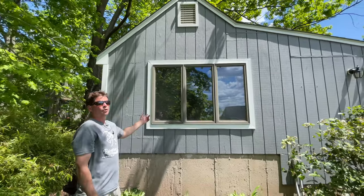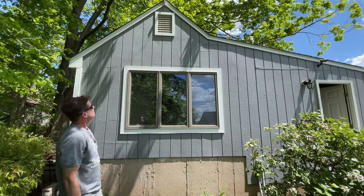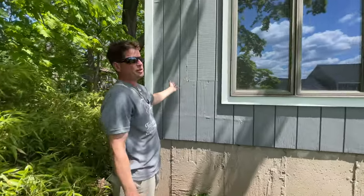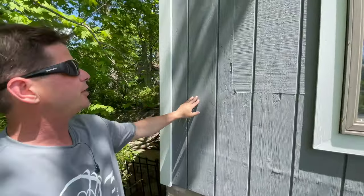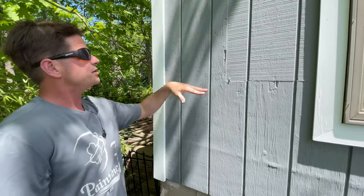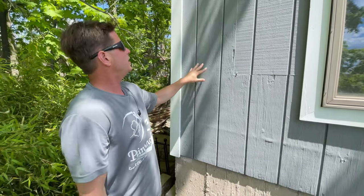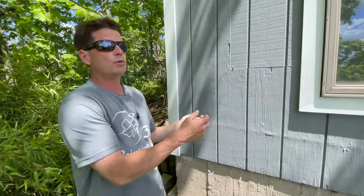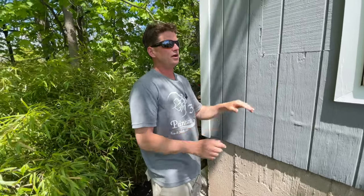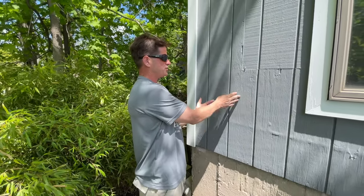I did decide in the morning here. Now the sun is starting to come around, so you're able to see everything. Now this is the area right over here that we started with, where there's all sorts of peeling paint and whatnot. After I pressure washed, we had to give this area about 3 days to dry out, because there's a tree over here, and this part of the house or the barn only gets sunlight in the latter part of the day. So we let it dry out, and I showed you what I did for prep work. And again, it's important not to use a palm sander on stuff like this, because you'll just make the wood worse, because you're not dealing with a smooth flat surface.